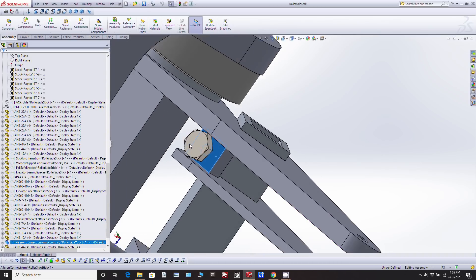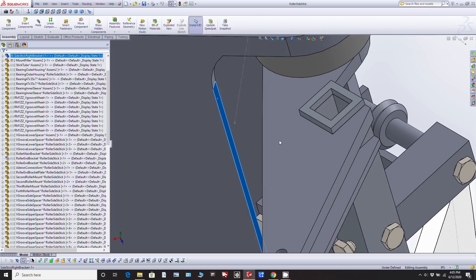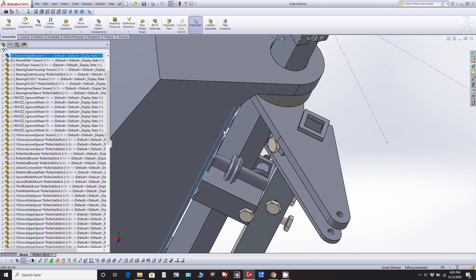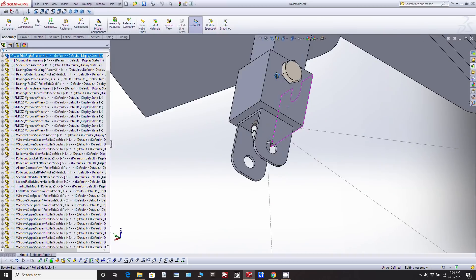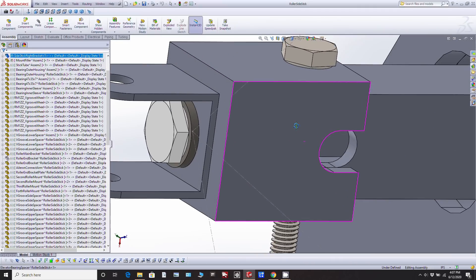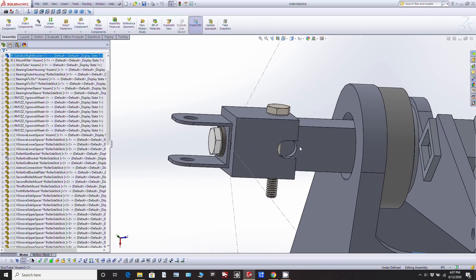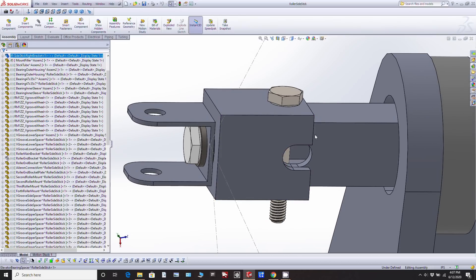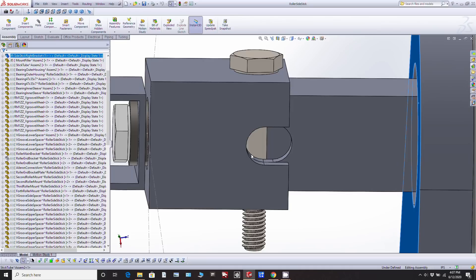Behind there I've got a little plate with a threaded hole and a bolt in there — this will be the stopper, hitting up on here, and it's adjustable with a locking nut behind it as well. You only need one of those on either side and it'll stop it from going beyond where you need it to stop in the left and right directions. Next up I made this opening in here for where the cable is going to come out — the cable that connects to the stick and has all the buttons on it that plugs into the avionics. That'll just come out this hole in the end of that, and this cap is the preventer to stop it from getting chafed. I'll probably just put some extra heat shrink around it there to protect it.